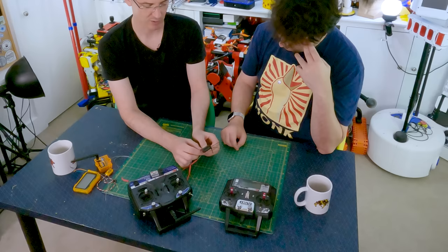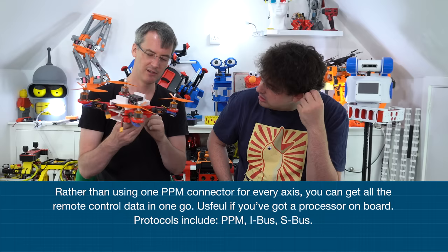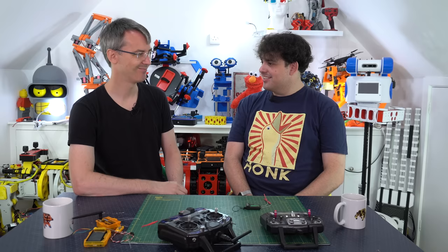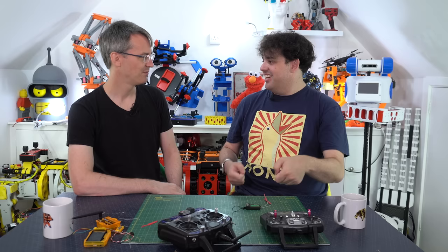It's also got two other protocols - PPM and IBUS. So rather than plugging into a million things, you could plug it into a flight controller. There's one wire in this drone and all six channels are built into that one cable. On my projects I'll generally use IBUS, read that into an Arduino, and get the data out that way. You've got this Arduino-controlled robot with all this code to make it work as a robot, and all you need is some joystick signals - so you use IBUS to bring in that data.